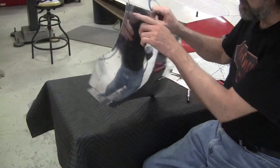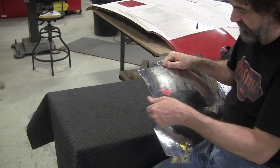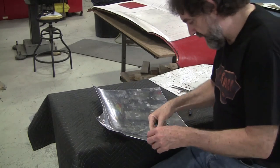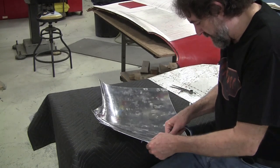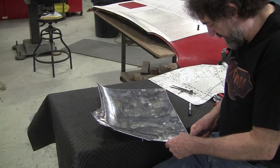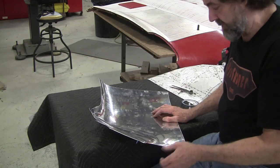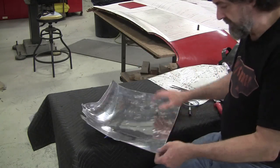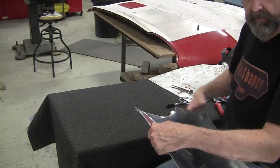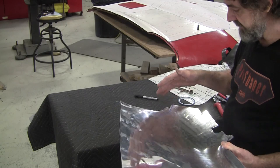This is the master line — I'm not going to remove that because when I'm done, that's going to be right on the edge. That outer blue line will be right on the edge. Now I'm going to take and put this on. I just love blue tape for cutting and marking of any type — I use a lot of it. It's so accurate, you can make beautiful lines with it. You can lift the line up and change it, and it's so good to be able to see it when you're cutting or doing any operation. It's much better than a magic marker line. So now we're going to go over and tip this on the tipping wheel 90 degrees.